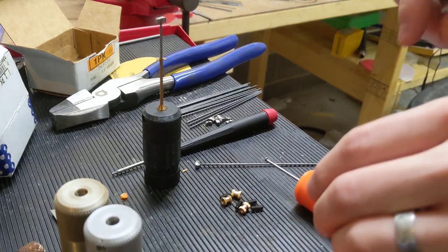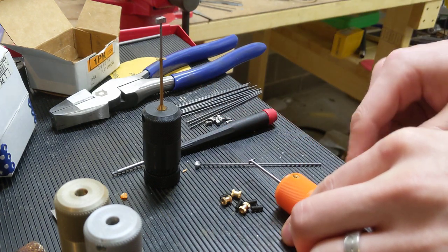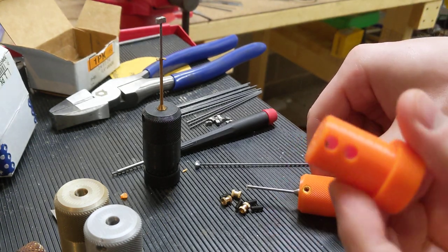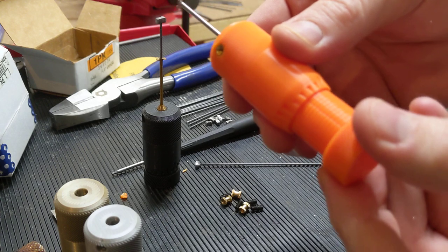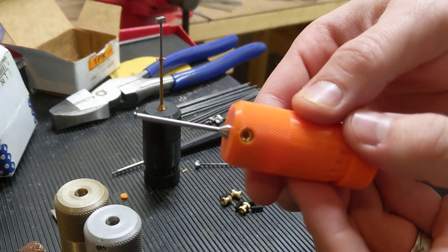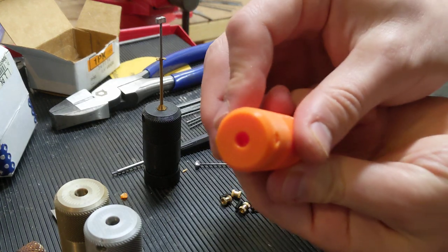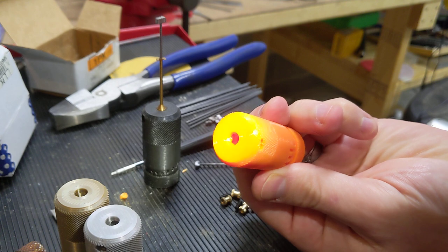It's going to be pretty hot so you don't want to touch it at the moment — let it cool, and that's it. On the front handle it's not really that critical, but on the rear handle you do want it a little bit lower than flush. There's a little bit of tolerance so you can have it even slightly raised, but you don't want it super raised up. Down in the hole there may be a little bit of plastic in between the threads and the tip — yeah, there's a little bulb of plastic in there.